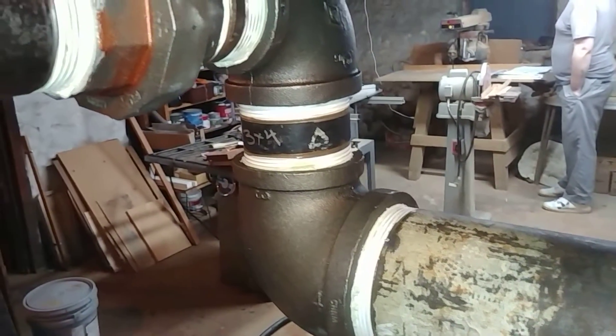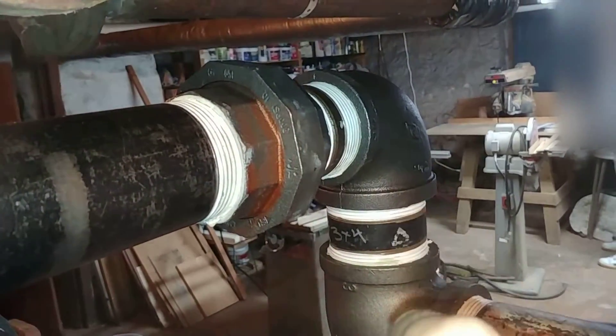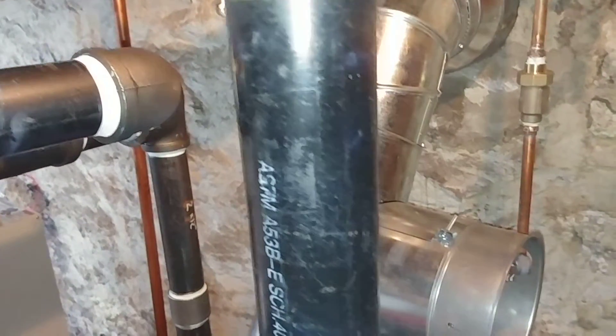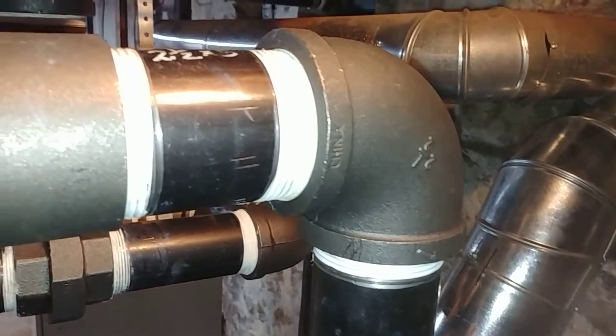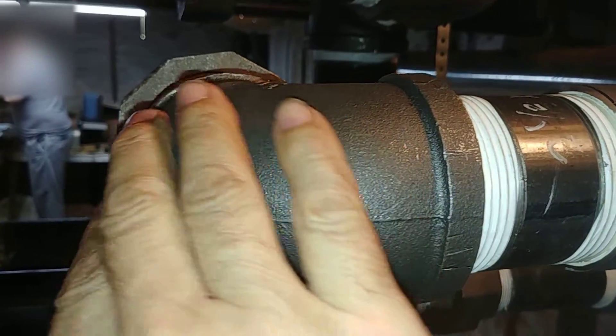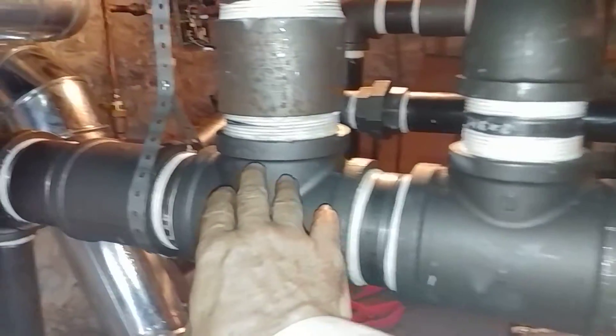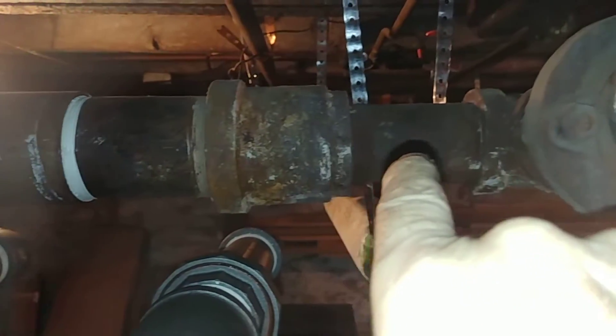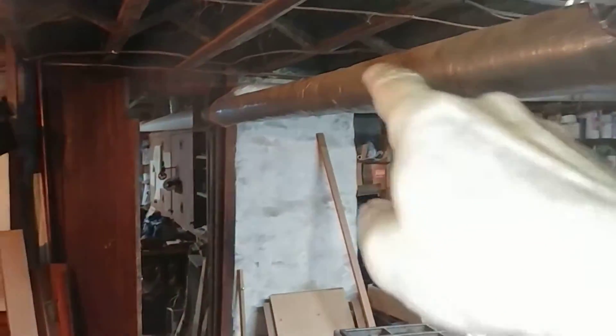The header is oversized pretty massively, and this is what is known as a drop header. You can theoretically go straight in, but that extra swing joint provides for better pipe fitting and also drier steam. Since we're running into a space problem, we've brought this over and tied it into the header here rather than there. Our first takeoff is a four inch, going into — I think it's three inch — and that's a T going towards there, with another supply going out there.